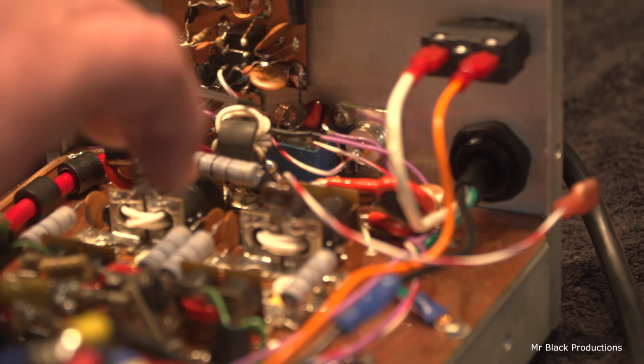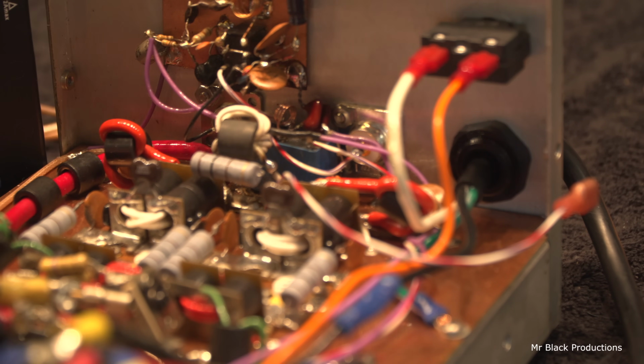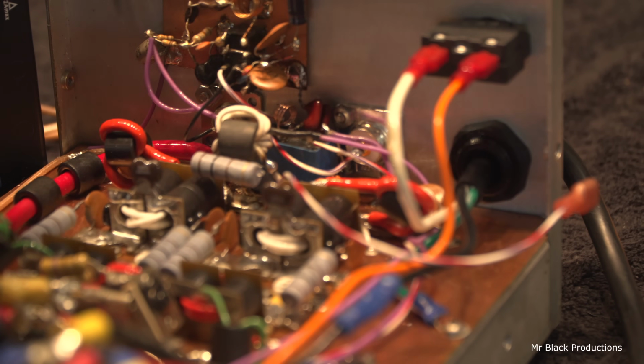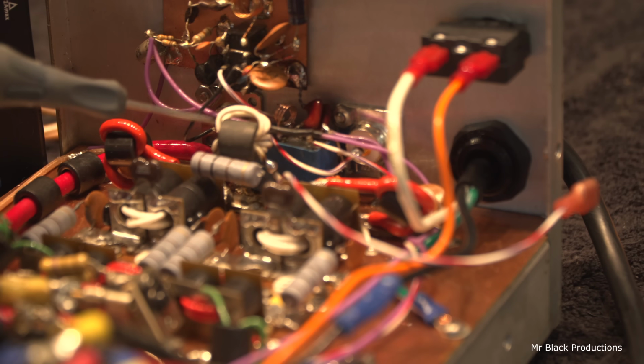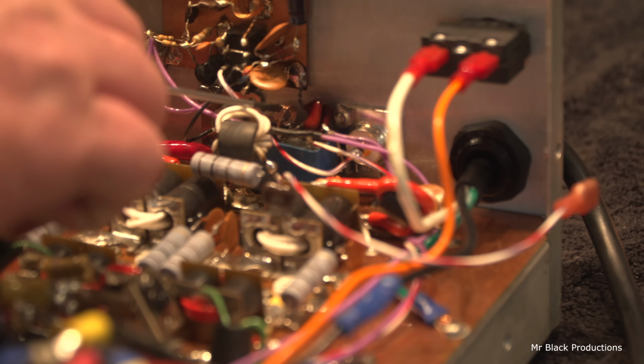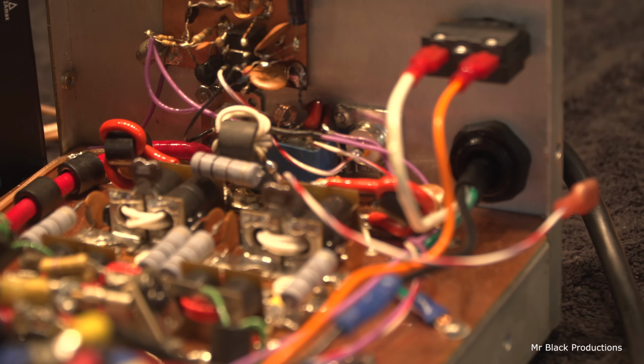So I went ahead and did this little 3-turn coil on the pass-through relay. Right now the relay is sitting like this, switched to these back posts. When the amp goes into operation, this wire moves over internally, the connector hooks up to our output combiner transformer, and then it jumps over to this piece of coax that runs down and goes up the front of the box. So the only place I can add inductance was right here. And so then you have two places that you can add inductance, pre and post induction coil.